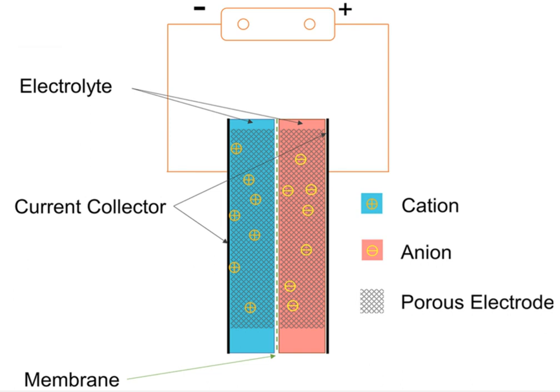Self-discharge. Storing electrical energy in the double layer separates the charge carriers within the pores by distances in the range of molecules. Over this short distance, irregularities can occur, leading to a small exchange of charge carriers and gradual discharge. This self-discharge is called leakage current. Leakage depends on capacitance, voltage, temperature and the chemical stability of the electrode-electrolyte combination.